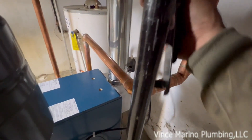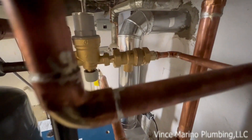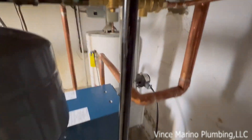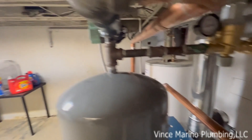The only thing I don't like are these Caleffi fittings — they seem to have a problem with the gaskets. No matter how much you tighten them they still drip; you've got to wrap Teflon. But in the meantime, this is the end of this Dunkirk.